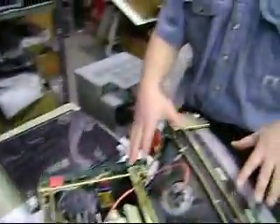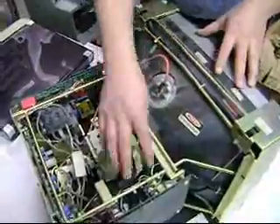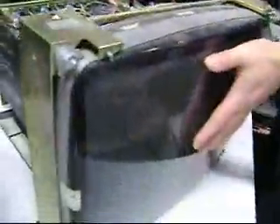As you scroll down here, you'll see the part number. We've written it down because it's so faint — it's a very, very old monitor. The part number is E01973-20B. What we're going to be doing in the next few video clips is taking the CRT off, taking all of the electronic parts off, and we're only going to be left with the frame. Then we're going to install the LCD monitor to the front, and we're going to have an adapter cable coming off the back.